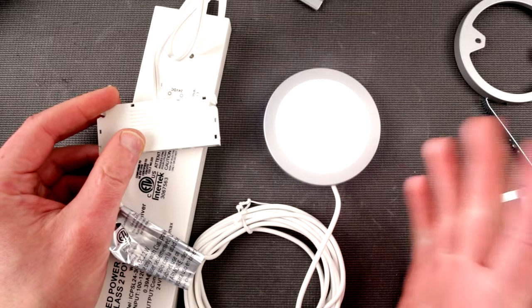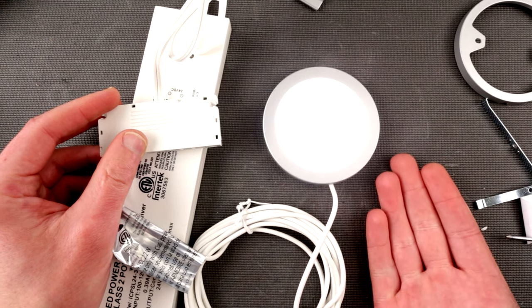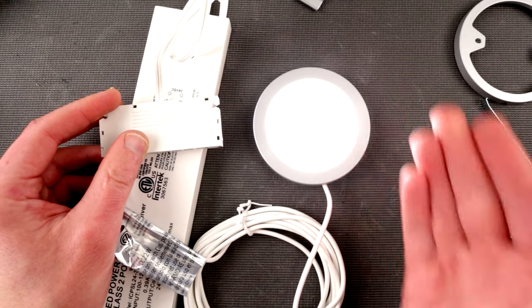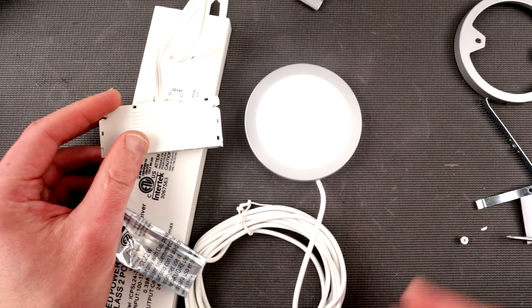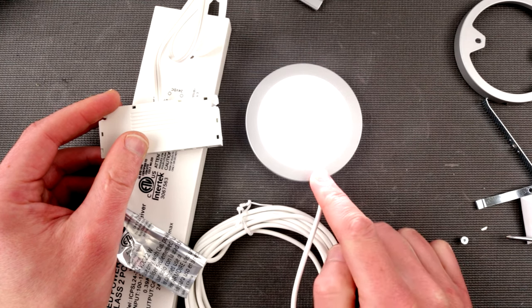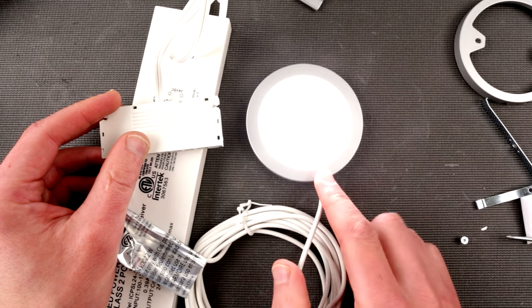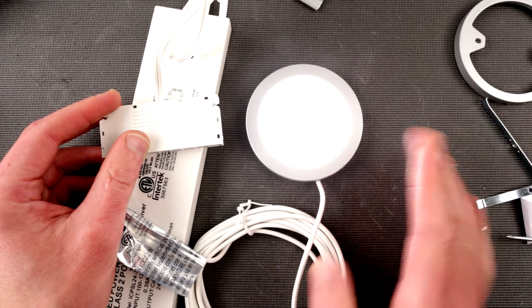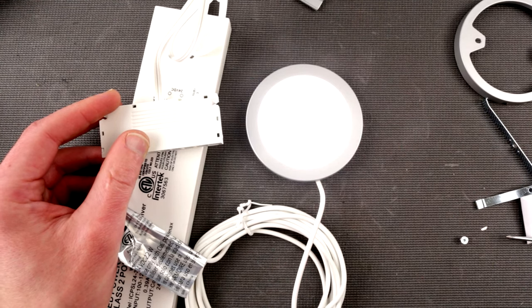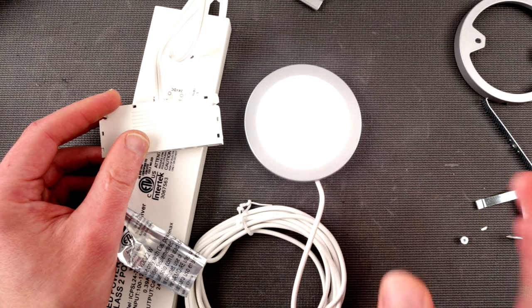If you want to use it for some other purposes, I'm pretty sure you can. For example, if you have some other 24 volt power supply, if you have a 3D printer, you can use it for your print bed light. Or if you want to use it in a car, I'm not sure if it's going to work properly, because 12 volt may be too low for those LEDs. I can test it for giggles, but I think it's going to be useless. You kind of have to reconfigure those LED strings.